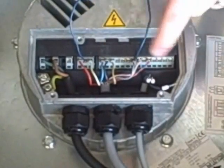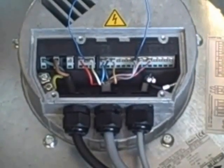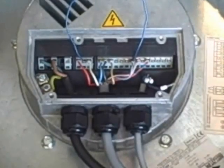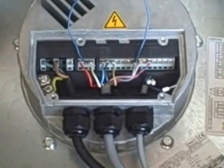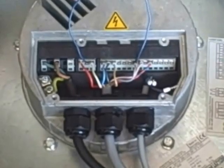Now all wires are in place. A jumper wire gives our control voltage to our lights and failure alarms. The potentiometer is now completely wired in. When we turn power on you'll hear a click, and the fan will only go as high as the input voltage provided by the potentiometer. In this case the potentiometer was set to about half speed, so it will only run at about 50%.